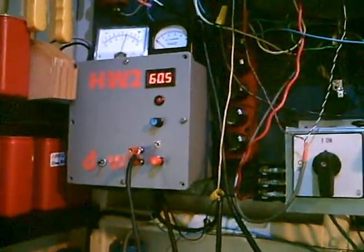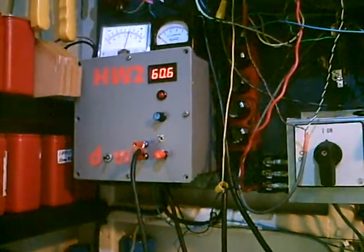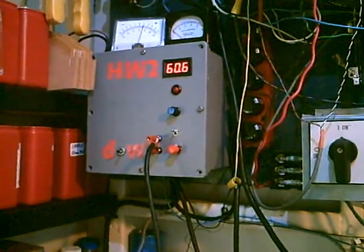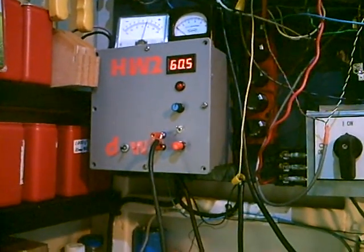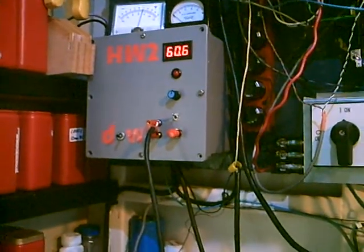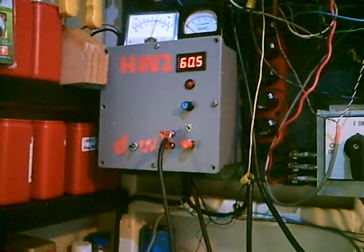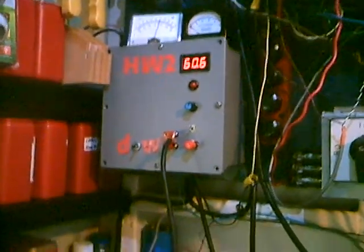I have a dishwasher that runs off the inverter, but it only draws 100 watts, exclusive of the heating element. I run the heating element directly off the PV bus, which is about 60 volts. The dishwasher's got extra insulation. The system works because I feed in about 125-degree water anyway, but I do have heated dry.